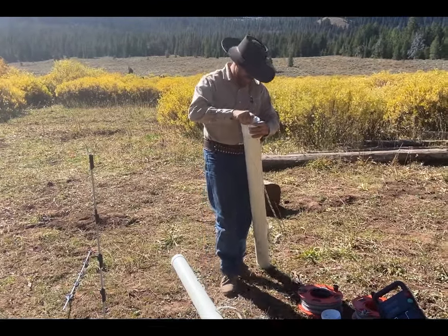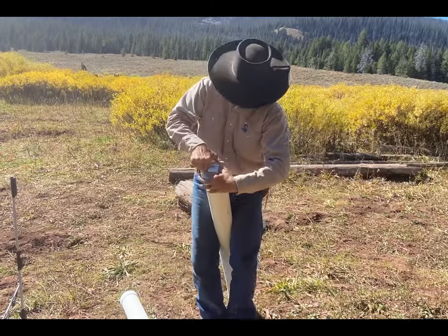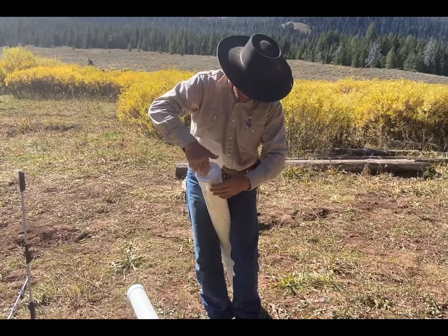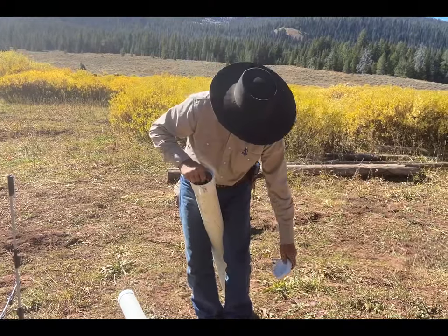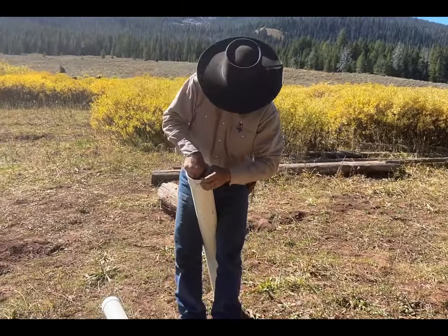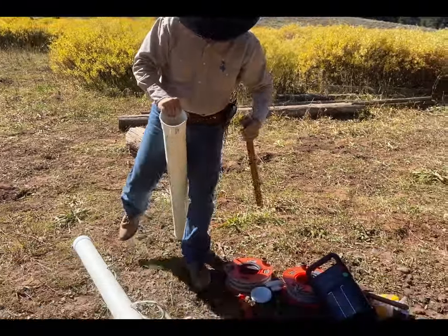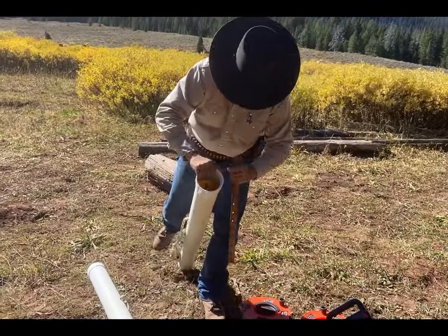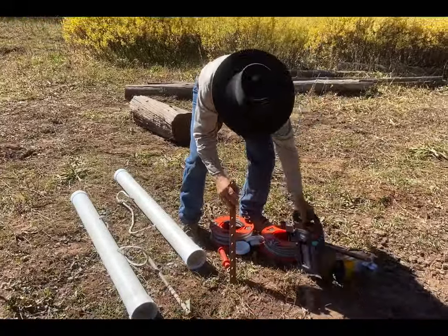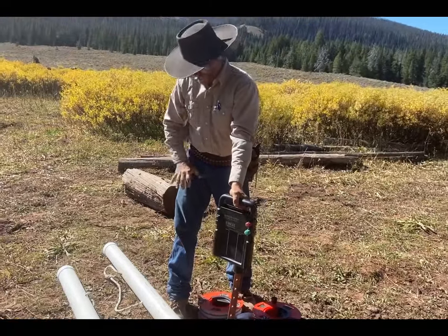Inside that tubing, I set out the grounding stake. On this tubing, what I have is a little short T-post. Now remember, all about packing in the high country is you've got to make sure the weight is the same for each tube. So inside of this one, I had a handle for a gate to offset that piece in the other tube, and also I had to offset that spike, so I had a little shortened T-post. You can see in there I had more of the fencing extensions. This T-post is used to sit in the ground, and you just put your electric charger right on top of it. That's why I have it equaled out for weight.